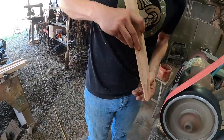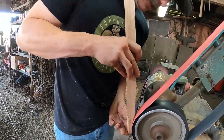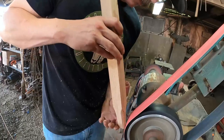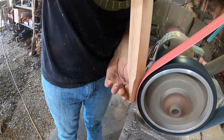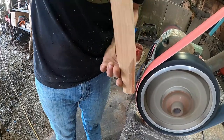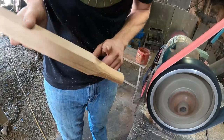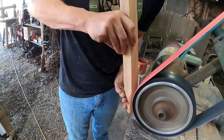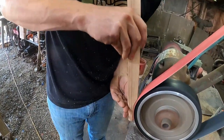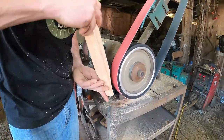Yep. Just like forging the faces on our hammers. And then I take those little lines and blend them in a bit. Start making an oval. And then just from trial and error, I always know this spot right here gets in the way of the cheeks. So I just take those a little bit more. I'm rounding while I'm doing it.